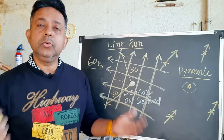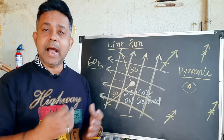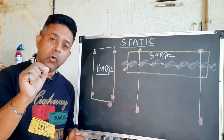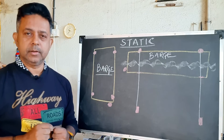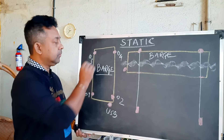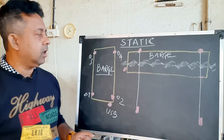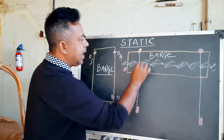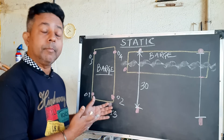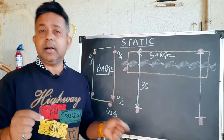But what if you do not have diver or ROV support? Then the next best thing is to do a static calibration. To do a static calibration, you need four offset points very accurately measured along with your USBL transducer offset points. You lower four beacons from those four offsets simultaneously at exactly the same depth. Before lowering the beacons, make sure your barge is completely secured with all anchors — at least four, preferably eight — with minimal movement.